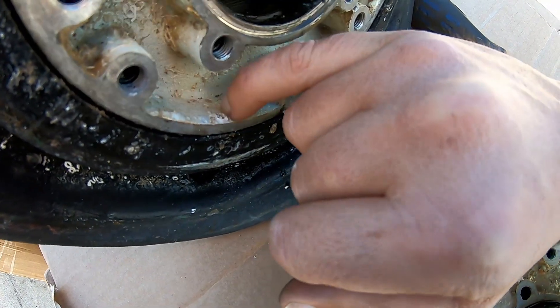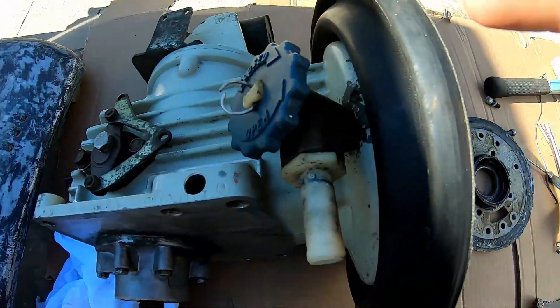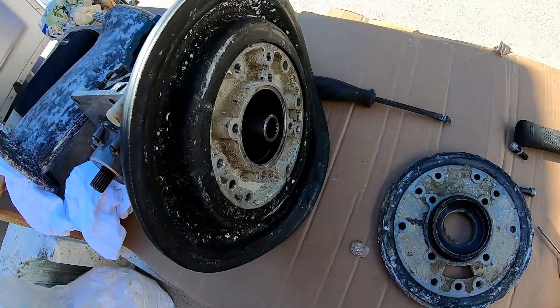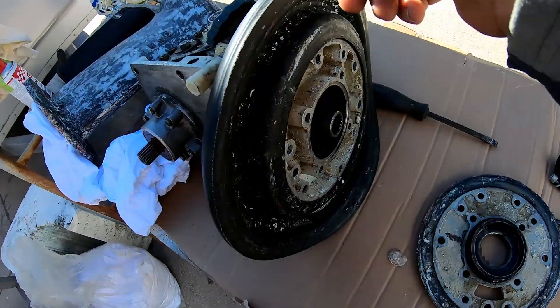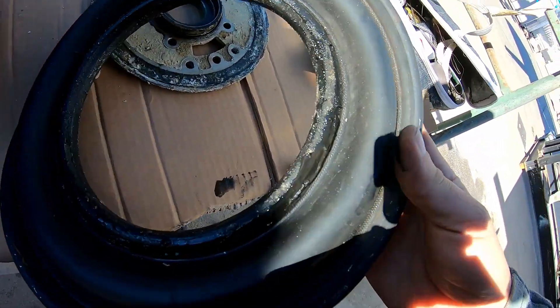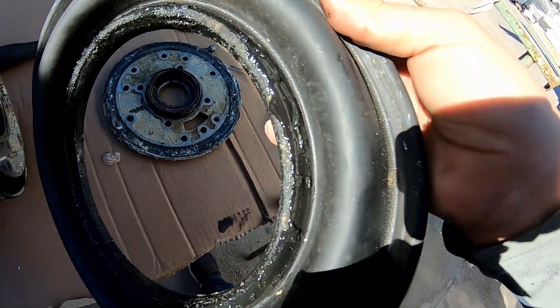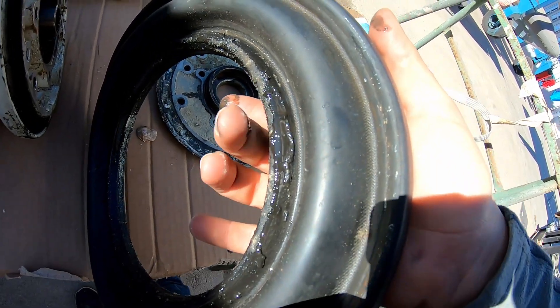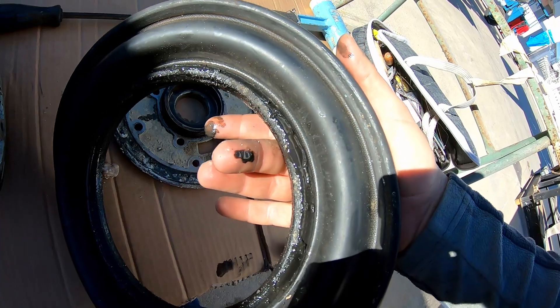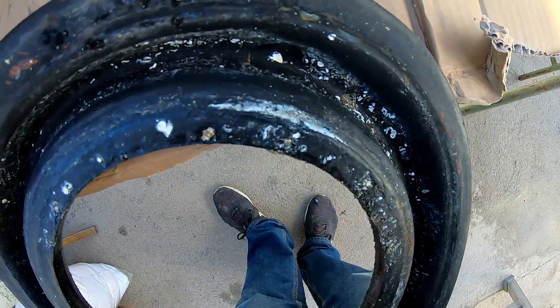A bit of paint fizz. It's generally looking not too bad. Here's the hole which goes to the tap here, which then goes to the motor. I'll clean all this up and replace this boot. I'm impressed that the boot is actually surviving on the inside, because this is exposed to a lot of oil - you can see the gooey oil from the engine, small leaks over the years, always collects in here. You would think the oil would destroy the seal from this side, but that's not the case. It's the salt water and the sea life that tend to destroy it.